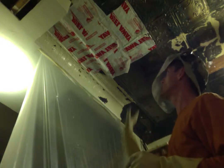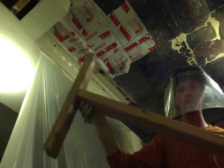So what you need to do is apply some kind of pressure to that. Now on the ceiling, how are you going to apply pressure? Well, I made a little device to do this. I'll show you how I did it. I basically got 2x4s from the hardware store, and I made something that's about as tall as my ceiling, a little bit shorter. On the bottom of it, you can see that I put a bracket on here to hold it in place, or I just nailed it in place down here, so I have a base to keep it steady on the bottom. I put the T part on the bottom, and I use this to brace it up top.